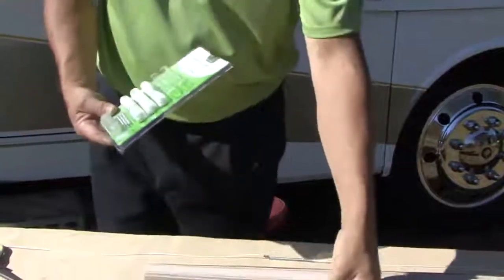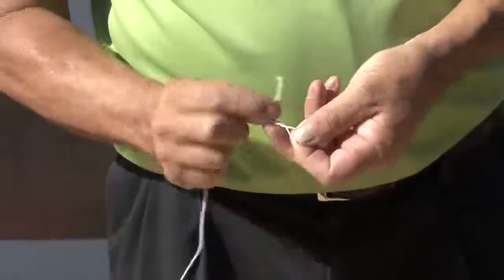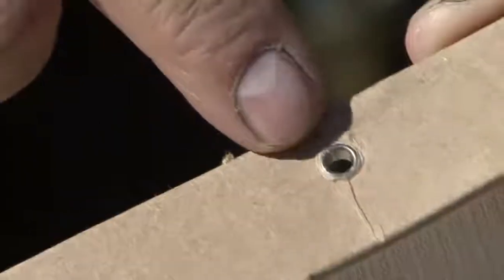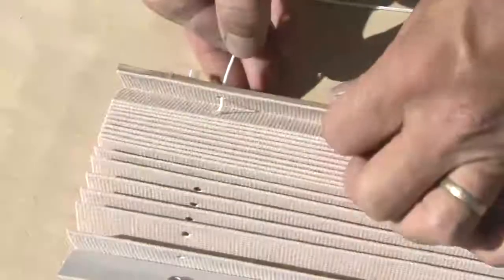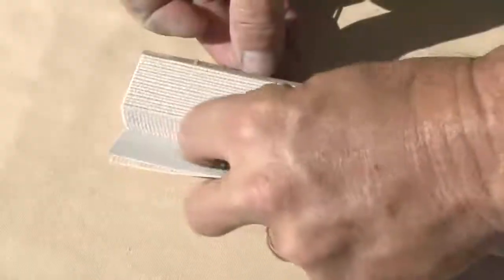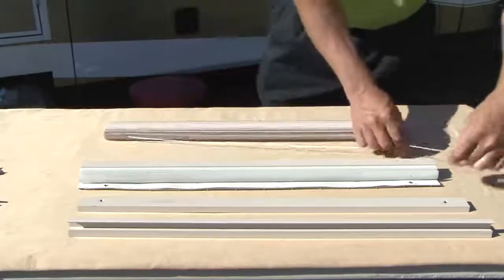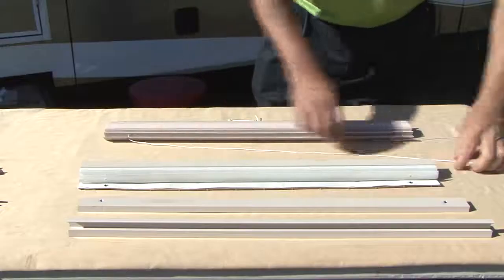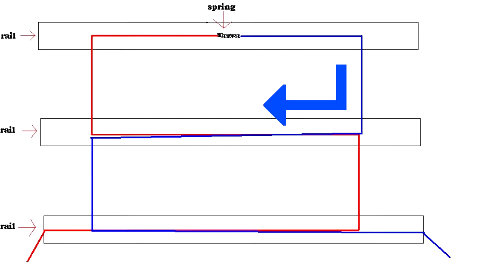Remove two new cords from the first aid kit. Attach one cord to each side of the spring by tying a double knot. Inspect the cord bushings in the fabric, and if any are broken or worn, replace them with the supplied bushings from the kit. Carefully thread the cord through the bushing, noting that the cord from the left runs down through the left side of the material and the cord from the right runs down through the right side. The cords will cross at the bottom of the center rail so that the cord running down the left side crosses over and comes out through the right side of the bottom rail. Repeat this same procedure for the right hand side of the shade.